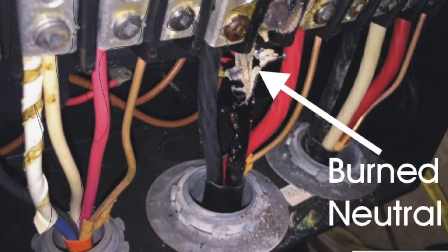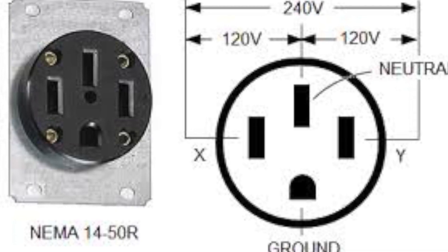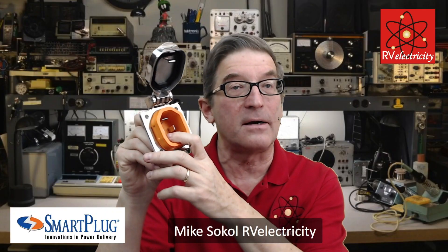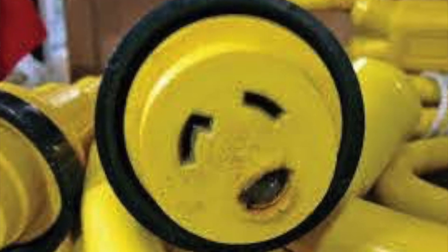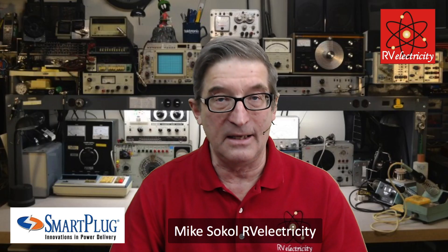The really fun test is I'm taking a 50-amp unit and I'm going to try to pass 100 amperes of current through the neutral — because that's what happens if you're in an RV park and they've miswired the pedestals so they don't have actual split phase. I'm going to see how this fares with 100 amps. Normally these other plugs just melt down right away. I can take pictures in false colors with the FLIR and see how hot it really gets, so stay tuned for that from the Functown Skunk Works.